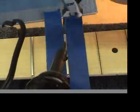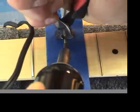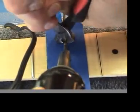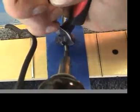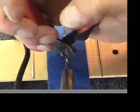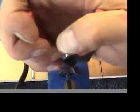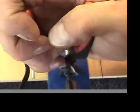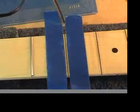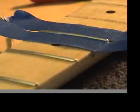And I'm going to grab right on the edge here, grab it solid, kind of rock it a little, get it to work up a little. And I'm squeezing with the nippers, and about the midway point, you're going to feel the nippers just slide right under it, and there you go. The whole fret easily starts popping right up. And you get to the end, grab onto it. Again, gently rock it. It's important to take your time with this. Don't try and rush it and pull it out without it wanting to come out easy. And there you go. There's the fret.